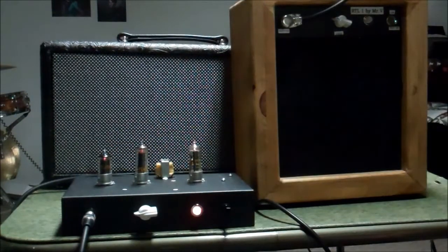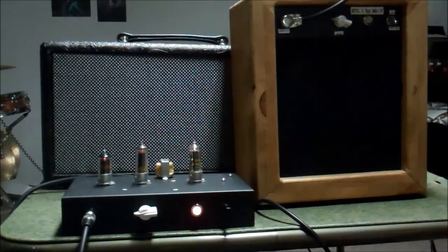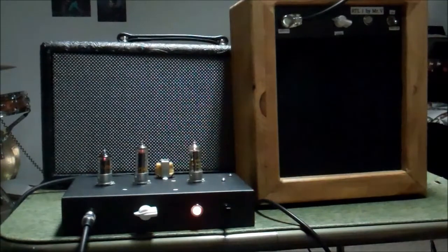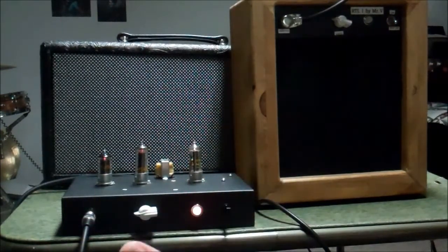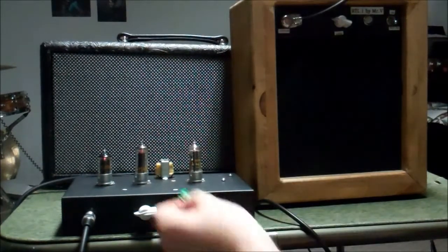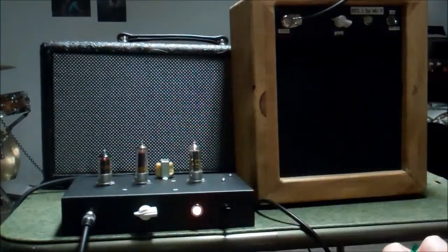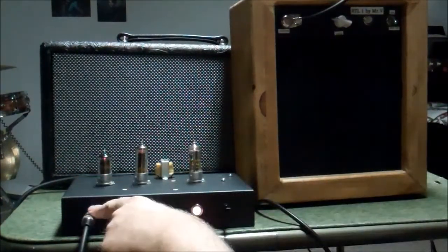This amp is totally backwards from most amplifiers. Most amplifiers that have a preamp stage have something like a 12AX7, or a 12AY7, or a 12AU7 — something with two triodes. Two triodes means you can put your guitar into the first triode, get some amplification, then go to the second triode, with your volume in between the first and second triode. That's typically what's done. But this one is a pentode — this is actually a pentode — and this is a beam tetrode. So we have a pentode and a beam tetrode: a lot of gain, one tube, one stage.